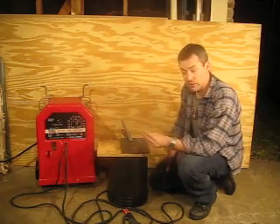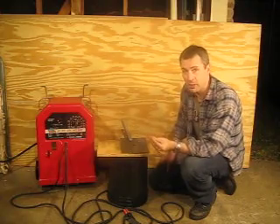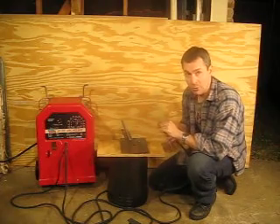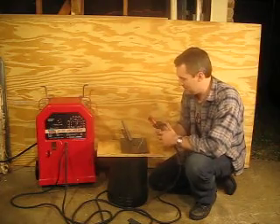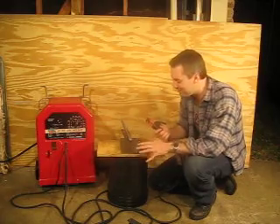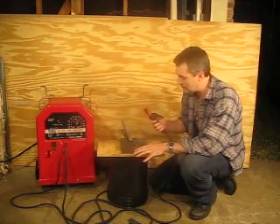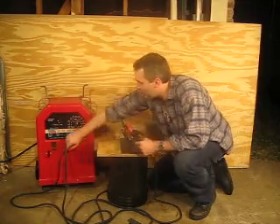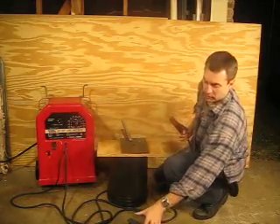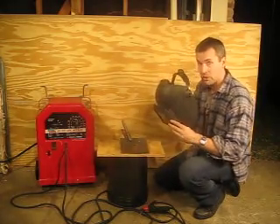Right now I'm using a really thin rod. It's a 6011, a really common electrode type. I'm going to go ahead and put that in the clamp, and you're going to see me weld some really ugly beads — it's really exaggerating it to call what I weld beads — but whoever you are, you'll definitely produce better looking stuff. This will at least show you that it works. So I'm going to flip it on. You'll notice it starts right up, no problem. I'm going to put my helmet on and weld some.